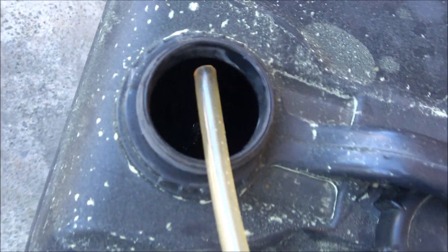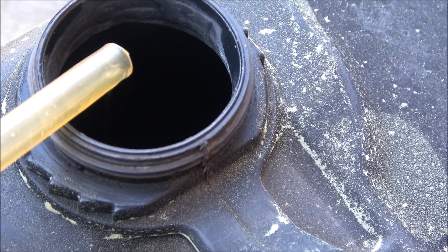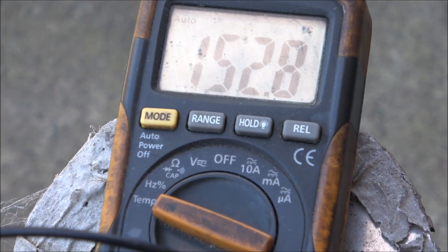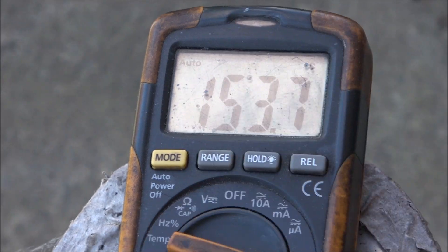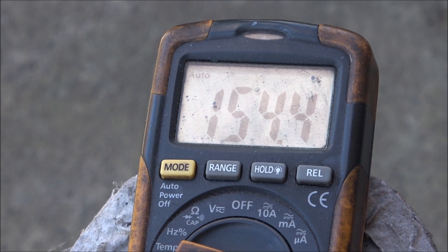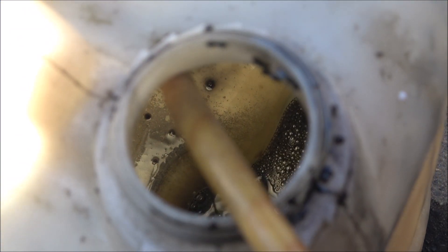We've got the start of production. I think I'll need to collect it and check it — temperature is 152°C, climbing up a little bit. Still a long way to go towards 176°C, so I'll let it increase. The separated oil should come out without any petrol in it.